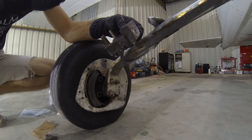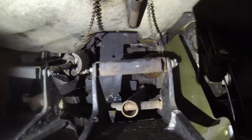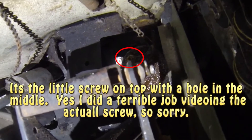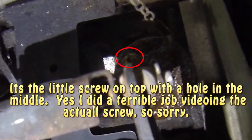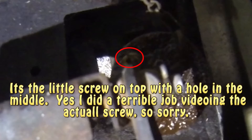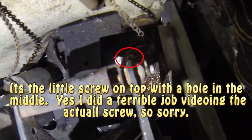You don't get any air in the system, and then go ahead and make sure you top off your brake reservoir at the master cylinder itself. So that's our master cylinders — one on each pedal, behind each rudder pedal. That's what we're going to fill our 5606 through. We'll go ahead and top that off before we go ahead and press down the pedals and send more junk down through the brake line. We always want to make sure the master cylinder is topped off with 5606 so you don't introduce any air into your brake lines.